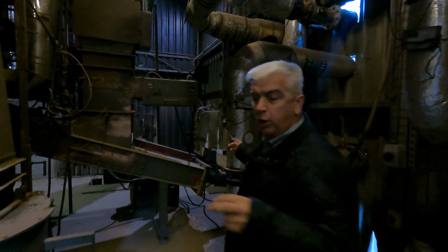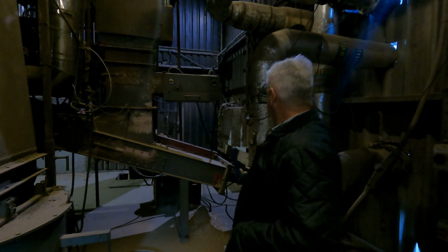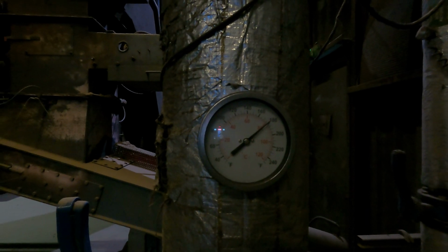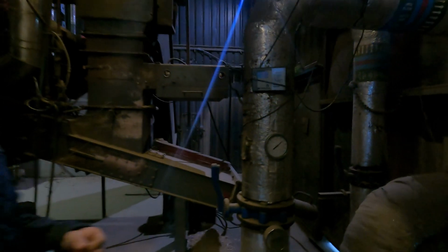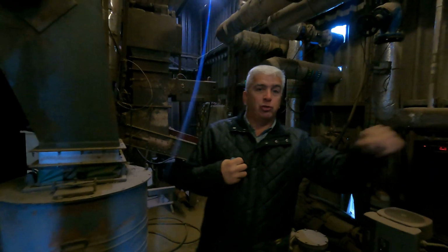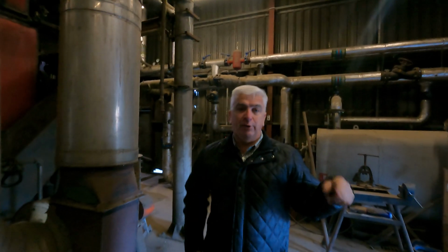We had a frosty night, buffer tank is empty of heat, but not water. And we're a little bit down on temperature coming out at the moment, so that should be around about 90, nearly 100. What is it now? It's about 80. Yeah, so she's struggling. That's managing, but it's only just. But the sun is now up, the glass houses will naturally heat, and that fills the buffer tank during the day, because the glass houses don't need the heat. So then at night that can come back and be used for heating the glass houses when this can't keep up with the demand.